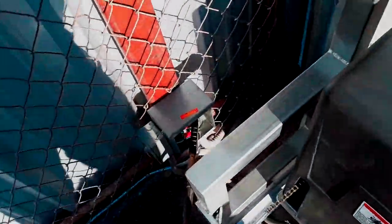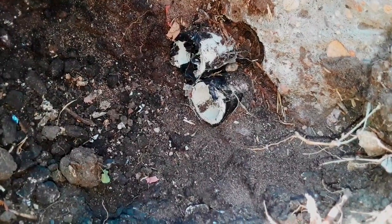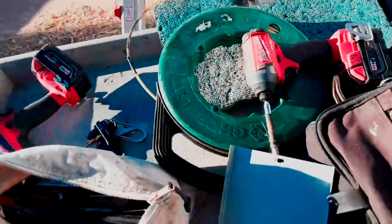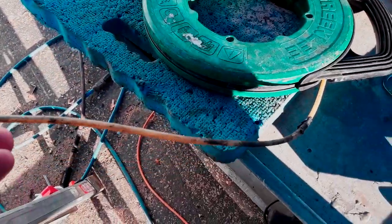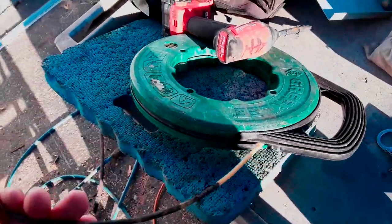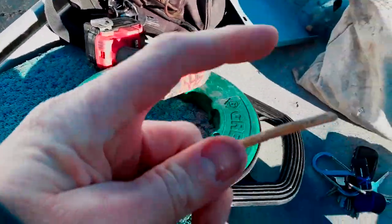We'll blow this out right now and see what it looks like on the other side. We went from dirt in the conduit to no dirt. We're going to have to go from three-quarter inch down to half inch and then make these bends, which is why we want to pull the wire first. I'm going to go ahead and put the fish tape through this side — I think it's going to be the easiest to start here. I'd typically use a metal fish tape but I only have a fiberglass; we've broken two metal fish tapes in just as many months.